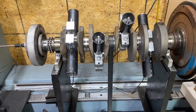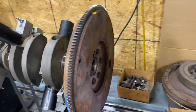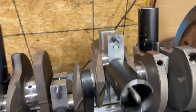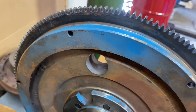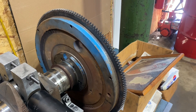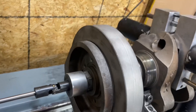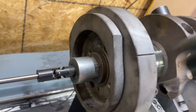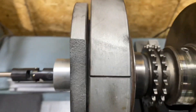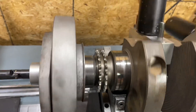Get ready to balance our 360 right-hand rotation marine engine. You'll notice there are a couple more pieces on here - we've got the harmonic balancer and the flywheel. The reason is this is an externally balanced engine. 360 engines are externally balanced. See that hole in the flywheel? That's what makes it a 360 flywheel - it's got an offset balance. A 318 or 340 flywheel is internally balanced, meaning it's a neutral balanced part. The harmonic balancer has this extra offset weight right there - that's how you can tell you've got a 360 engine, assuming nobody's screwed with it.